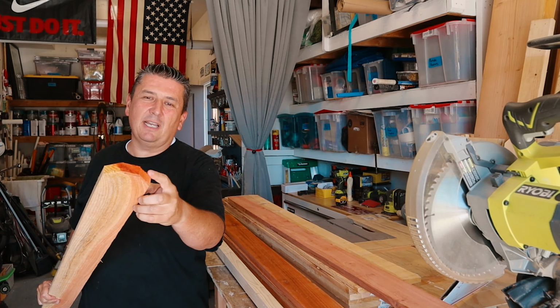Just imagine 1 fence picket represents half of the box, an L, and then 1 other fence picket will represent the other side and the other end. So I need 2 pickets on this side, and 2 pickets on that side, and then 2 fence pickets for the bottom. Pretty straightforward. When you cut the bottoms, you're going to be left with some extra. Every planter box you build, you'll have 2 pickets on the bottom, and that's going to leave you with 2 ends that you don't use.